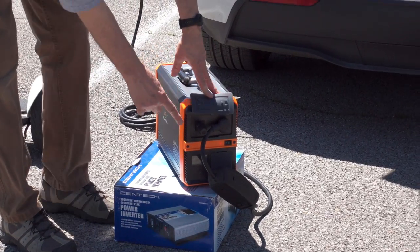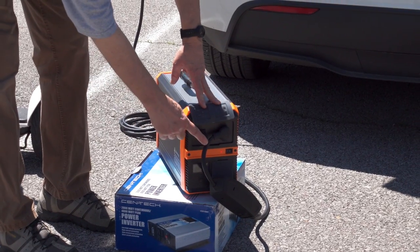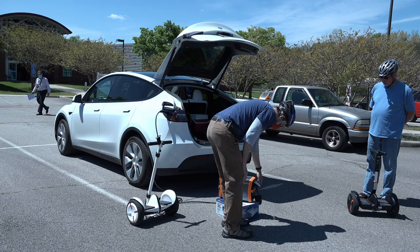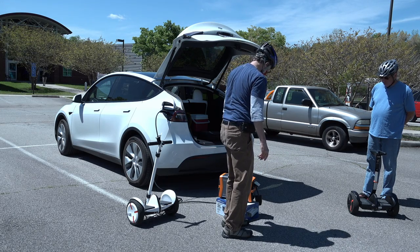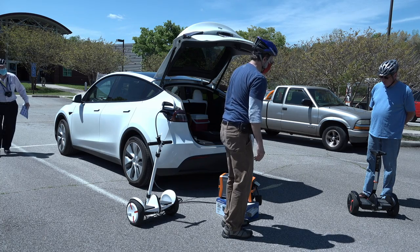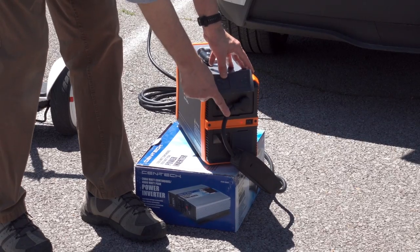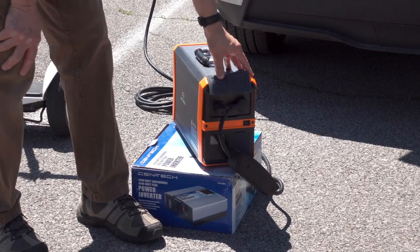So we have the typical thing every generator needs, a bonding plug, a grounding plug. That seems to be the thing that most people get caught on, because all these adapters have a safety interlock. Essentially, they're a built-in GFCI. And that safety interlock will not run unless it detects that it's grounded. The way it detects it is to see, are ground and neutral the same voltage? So the bonding plug fools it. This bonding plug allows this battery generator to run as if it were grounded.